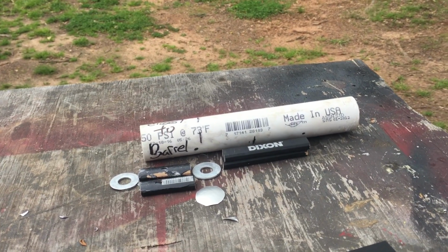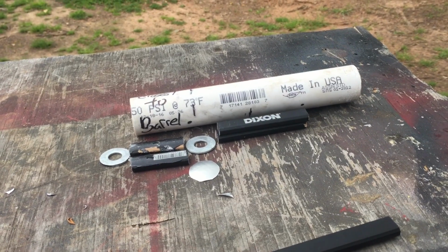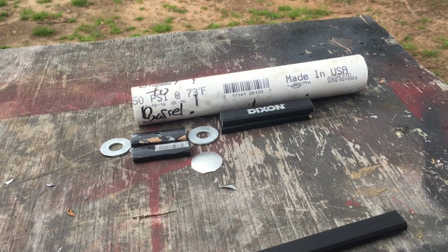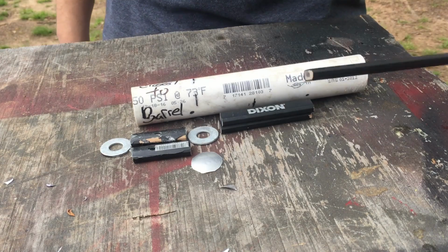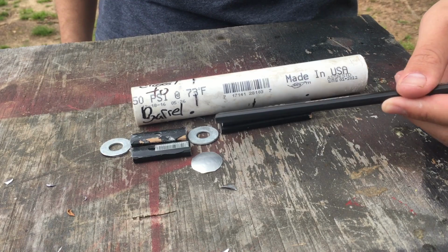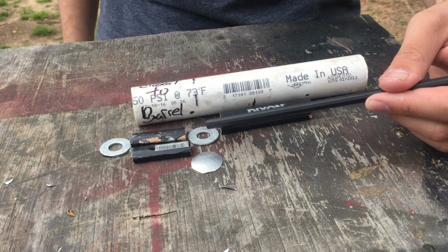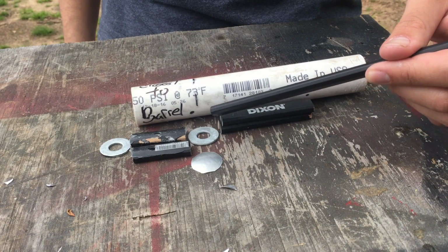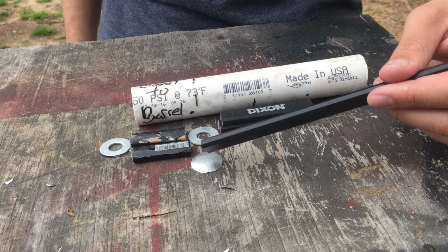So here's what the inner design looks like. The washers are the baffles, while in this case the carpenter pencils are the spacers that keep the baffles from being squished. I recommend that you don't use carpenter pencils because they are too big. Use nails or something else to give the washers strength. The soda can bottom goes on top of the baffles and will help form a more effective chamber.